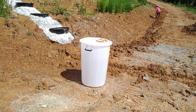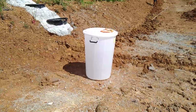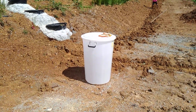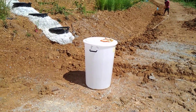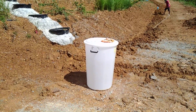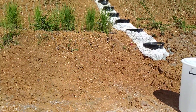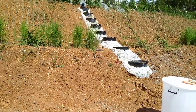This big white thing here has got to be buried in the ground as deep as it can go — actually more than three feet. I have to get it in about three feet. I've got to put a lot of holes in it, put it into the ground, and backfill it with clear stone. That's going to pick up all the water pressure from the other side, which is my problem.